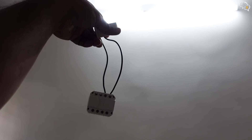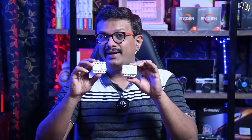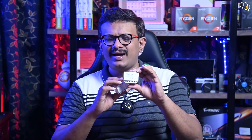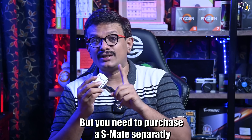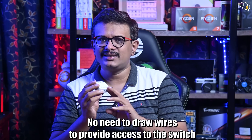This is an example of the switch working with the tube light in my son's room. The Mini R3 and the S Mate are really cool additions to the Sonoff smart switch line. The size has really reduced compared to the original Sonoff switches. The small size of the Mini R3 allows it to be hidden away and the S Mate allows for remote control, which is really cool. One con: the R2 had a switch input which the R3 seems to be missing, but the S Mate adds that missing feature and allows connecting up to 3 rocker switches wirelessly. This wireless feature is a boon but also a niggle as the battery needs to be replaced when it gets drained. A bit of an inconvenience, but now you can have the switch wherever you want.